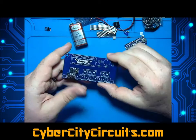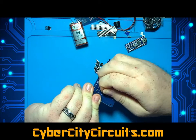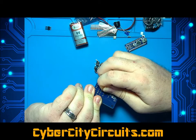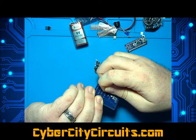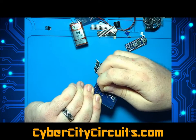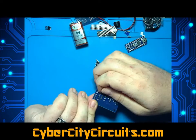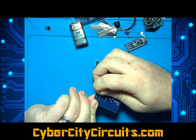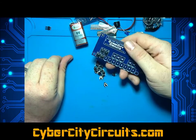And then what you can do is you can hold it with one thumb, and then with your other finger, just kind of take your fingernail and bend the leads down a little bit. But what that'll do is help keep the buttons from falling out. You get a good mechanical connection. We talked about this before. When soldering, if you can get a good mechanical connection, holding things on the board when you're soldering, it's so much easier. So like I do this, and then the buttons stay on the board. See that?